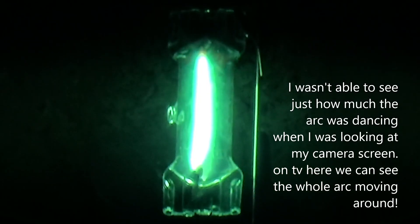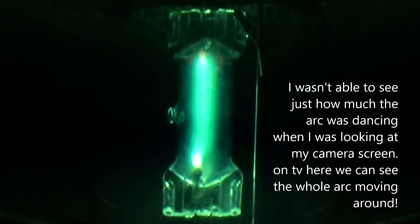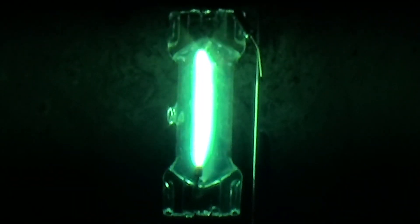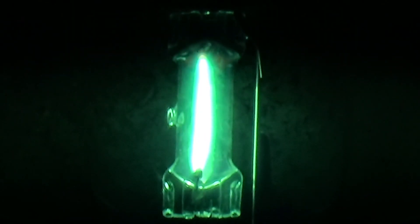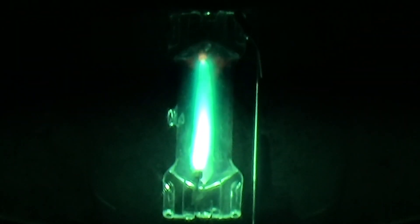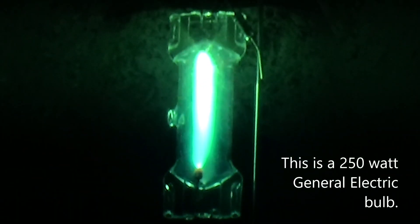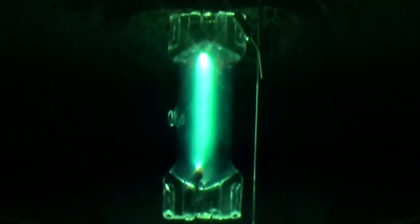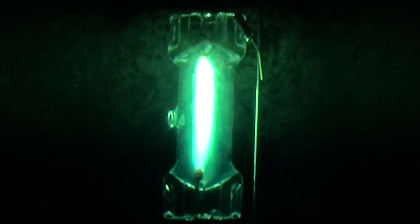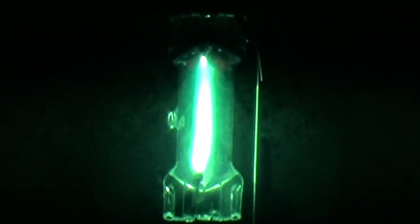That's really weird. I wonder why it's doing that. I wonder if this is more to do with the light bulb or if this is a ballast problem. On the kilowatt meter, it's saying it's putting 263 watts and it's running at about 2.63 amps, so it's a little over what it's rated for. Maybe this is a very slight over-current situation. The capacitor did test a little wee bit high — it's a 15 microfarad capacitor with a plus or minus 3%, and it was reading about 16.5, which felt like it's a wee bit over that 3%.